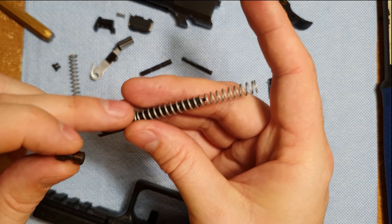To put my plunger in, I go ahead and put it in — I can see through the hole what that spring is doing and I can push it in. I'm pushing in on the plunger, then I take the ejector and get that foot in there, and that'll just hold on to the extractor. Next I'm going to get the extractor plunger, which puts pressure on the extractor — pop it in. Get my firing pin in. This next part's a little bit tricky because I need to push both of these guys in and then slide the end plate in there. I'm going to press on it with a punch. Shield your eyes — and it's all the way in.